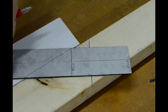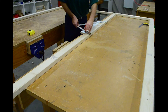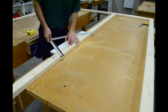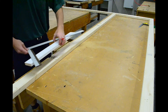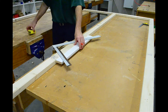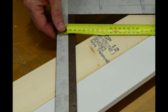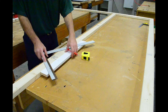So I just need to measure 1150 horizontally across my rafter, and this is where my 500mm measurement is going to come in handy. I'm simply going to line up 500 at that end, make sure it's nice and accurate, and draw a line there — that's 500. I'll go another 500 which gives me one metre. And now I just need to go another 150, so I'll simply go another 150 past that mark. And that gives me my 1150 run. You simply step up in 500mm increments and measure the last little bit to get to the run of your rafter.